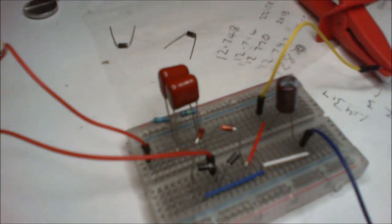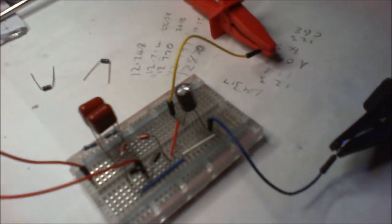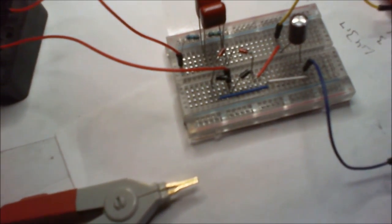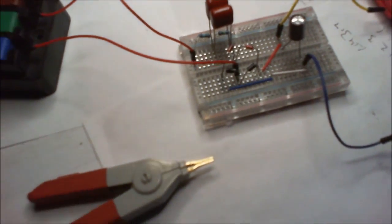Right, so as I was saying about this circuit, we're regulated 18 volts here. Now I put those capacitors in, so I can chuck this down now. I'm going to see. No, that's not a good sign. Now, I wonder. I think I just killed the zeners. Gotta check.